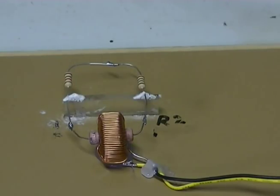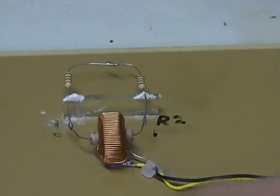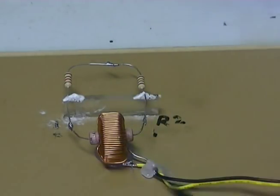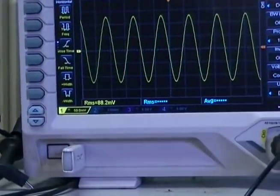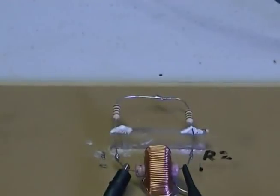If I worked out the resistance or impedance of the scope itself across our two measuring points of our probe, and put that value resistor here and looped it through our toroid, the voltage would be exactly what we see by placing the scope across this 0.6 ohm resistor. And that tells us that we are indeed measuring the voltage across the scope's internal resistance when we place our scope across a 0.6 ohm resistor, which gives us our 88mV — the exact same amount as the voltage across the other two resistors added up.